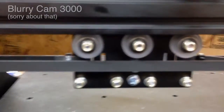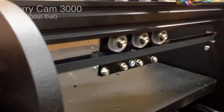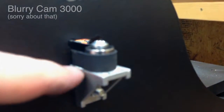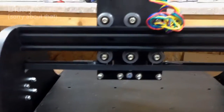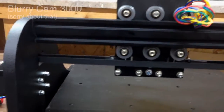I've now got the x-axis belt motor and pulley installed. This spins and moves your x-axis left and right, and that mounts to a bracket over here with the same idler pulley we had in the front — a stud with two bearings on it. It's riding a bit low so I may adjust the bracket, but it's not rubbing so I'm going to leave it for now. I'll leave adjustments until I fire it up and run it, since things can settle in.